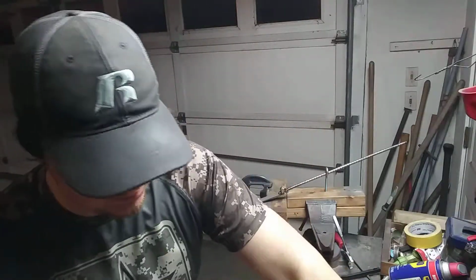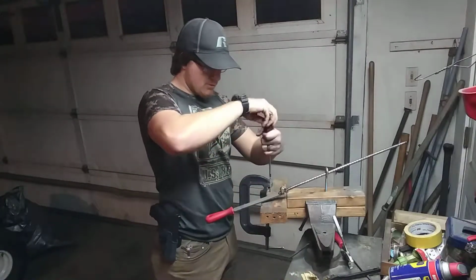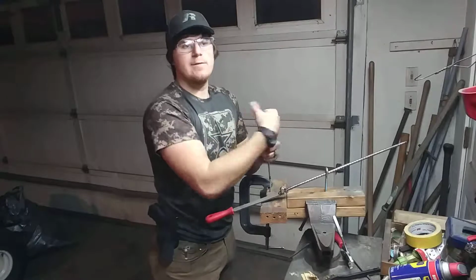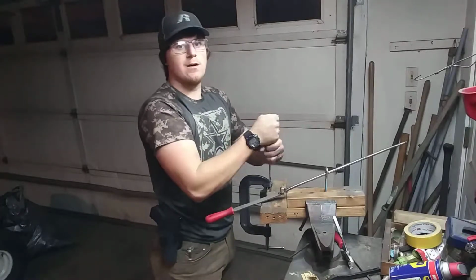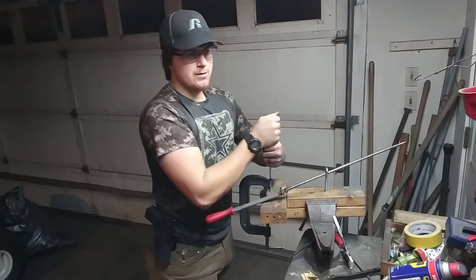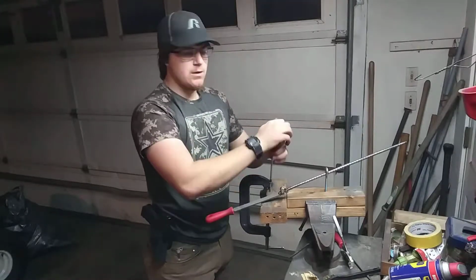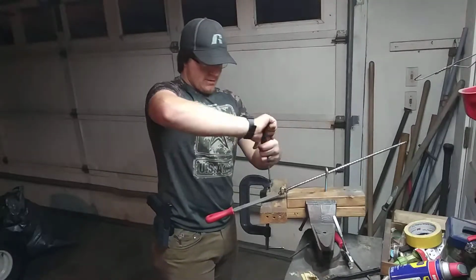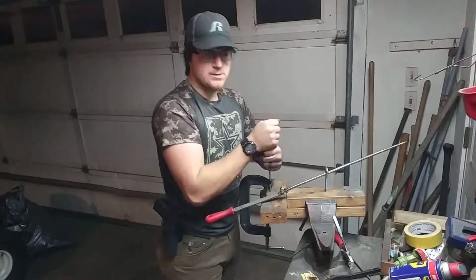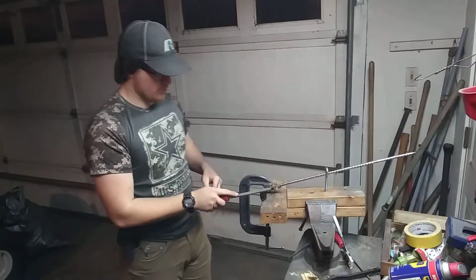If you don't, then just pay attention to your plunge line, pay attention to how it's looking, if it's starting to go backwards. Because if you want to make good high quality knives that look good, there's definitely knives that you make really quick and you make a ton of mistakes on. They're just educational pieces. They're not pieces that you would intend on selling, or maybe not even intend on carrying, just making them really quick to see what kind of skills you have and see how much you can learn from making that particular knife. But if you're wanting to make high quality stuff, then definitely take more caution or be more tedious. Use your stop screws, stuff like that.